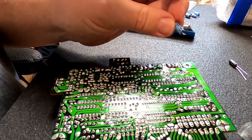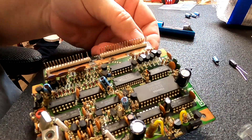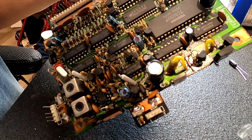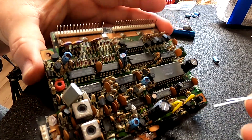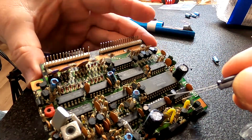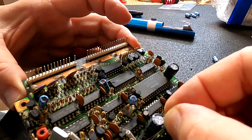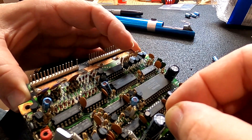We got it out. I've already double-checked the markings on the PCB — there's the area right there. I'll hold that up to some light and make sure I got all the solder out of the hole — and I did, you can see the light right through there. Next I take the new component and do a trial fit, straighten the legs. Remember on the cap the long leg is positive. I can get it in on that side so we've got to work on that side.